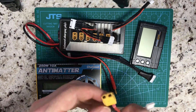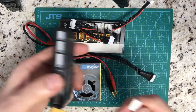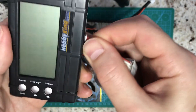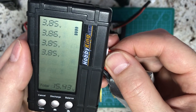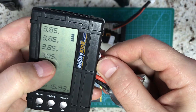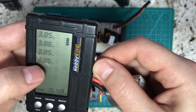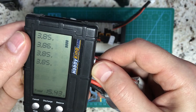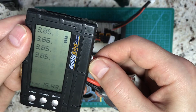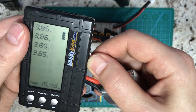Always avoid short-circuiting positive and negative. Every time before and after charging, check the individual cells — to start, around 3.85V is a little above storage value. Check that each cell has a similar voltage. If you are going to charge more than one LiPo together, they should not have more than 0.1 volt difference between any of the cells. Most importantly, don't mix 3, 4, or 5 cell packs — always charge the same cell number.